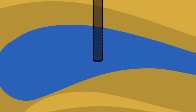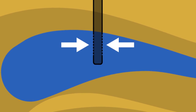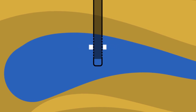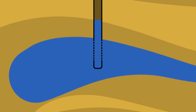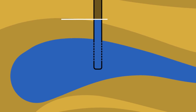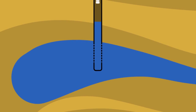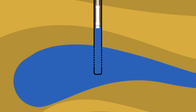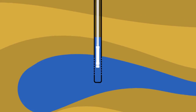A monitoring bore is designed so that water from the target aquifer enters through slots or screen in the bore casing. In most cases pressure causes the water level within the casing to be higher than the aquifer level. This is called the standing or static water level, or SWL. In the field we lower the pump intake below the standing water level and into the screened area so that the water being collected is coming directly from the target aquifer.